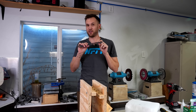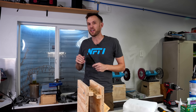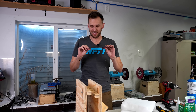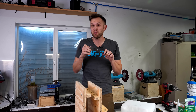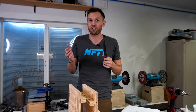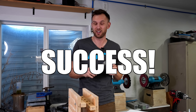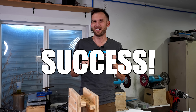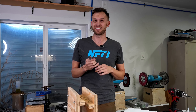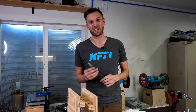Unheat treated, this knife was about a four or five — really off the scale, too soft. A really good heat treatment on it would have gotten it up to maybe 62 or 63, somewhere in that range. So this did harden — it did get harder than it was before. In that respect, we have successfully heat treated the knife. However, it's not a great hardening job, which probably means that, surprisingly, even surrounded by dry ice, it cooled down too slowly.